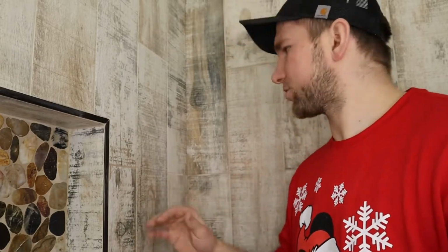So when you put acrylic caulk in there, you're allowing that stress to be taken by the caulk. It's flexible, right? That's how caulking works. Too many people don't do that. Is it going to cause your shower system to fail? Probably not. Does it look good? No, it does not. No way it looks good. It looks unprofessional when you see a crack there.